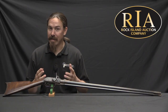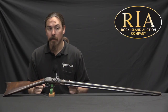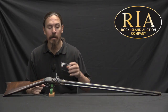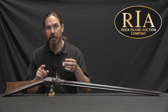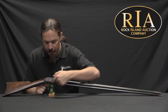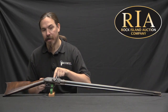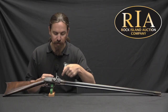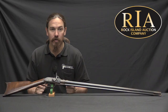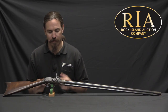In total, less than 1,000 of that 5,000 gun order were actually produced. By the end, you couldn't sell them to anybody because nobody wanted to deal with this weird rocket ball ammunition. The ammo for this thing was a lead bullet with a hollow base, and the base had a propellant charge of black powder in it that was then sealed. That would be fed out of a tube magazine on the bottom of the gun. You could cycle the ring trigger back and forth — it would load a cartridge — then you'd cock the hammer. There was a container of pill primers in the top of the gun, and when you cycled it, it would load both the cartridge and a primer, and then you'd cock the hammer and fire. It was an underpowered, specialized cartridge that nobody made except for whoever Cortland Palmer licensed. Ammunition was just hard to get for it.